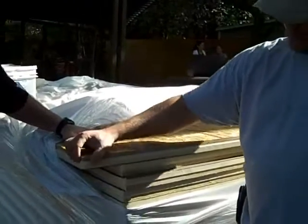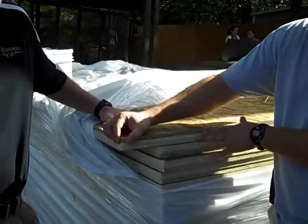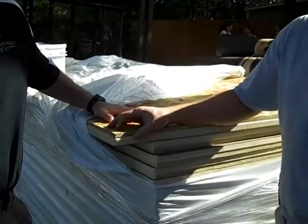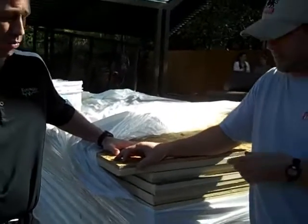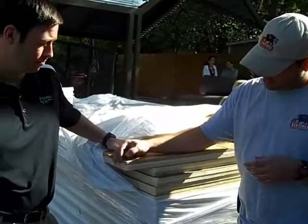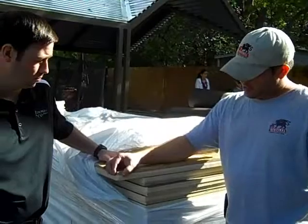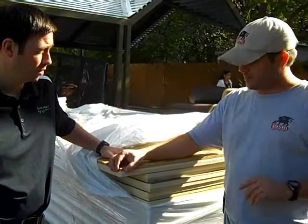It has the OSB board actually adhered to the ISO board itself. So on this house you'll have your ZIP system — we use the ZIP on it. The ISO board is sandwiched between basically two decking systems on top of the insulation that's already in the house.